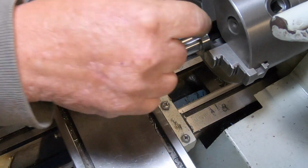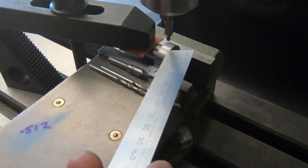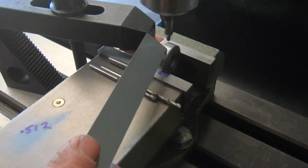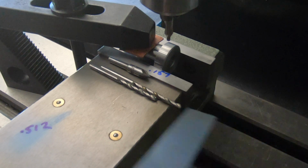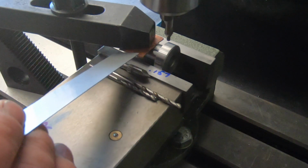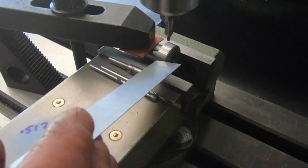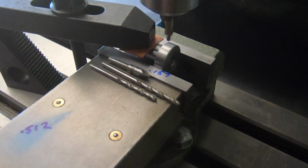Let's go and put this. Oh, I still got to drill a hole in there yet. It's getting a bit excited. The last piece of the puzzle. Got to put a set screw in here. I've found centre between the jaws. I've just got a parallel under there and this clamp just to make sure it is sitting straight on the parallel. I found centre of the flange, so it's got to be M4. So it's meant to be a 3.3mm drill. I don't have any 0.1 increments, so it'll be 3.5. I'm sure it'll be okay. There's plenty of thread depth there. So we'll give her a go anyway.